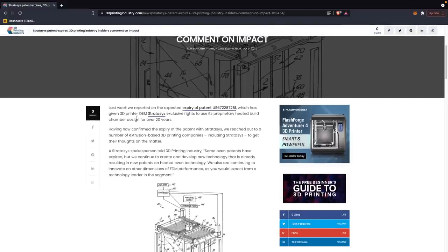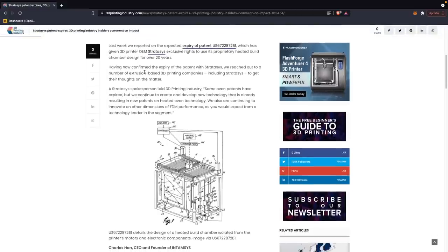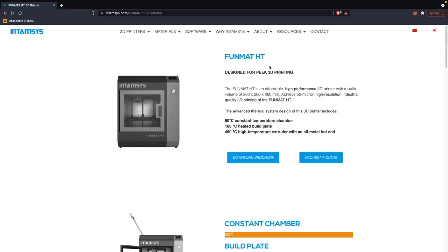The primary companies I know with actively heated chambers are Stratasys and MakerBot, which is also owned by Stratasys. They've had a patent on actively heated chambers for a very long time, which I believe expired earlier this year. I was wondering when we'd start seeing 3D printers with heated chambers now that the patent gates are hopefully open. It's really exciting to see it at this price point — the only other machines I'm aware of with heated chambers are two to three times the price. At 60°C it's not the hottest I've seen — some machines reach 90°C for PEEK or Ultem — but for ABS, nylon, and polycarbonate, that 60°C is really going to help.